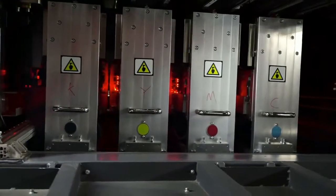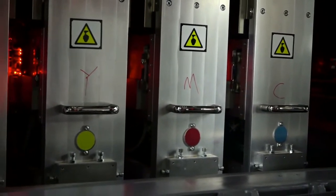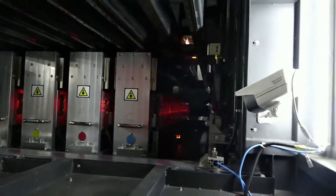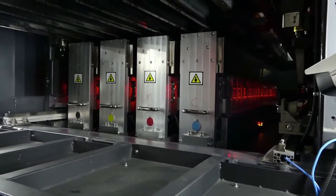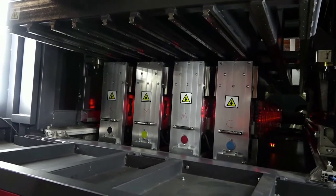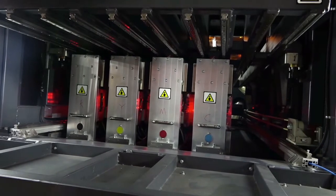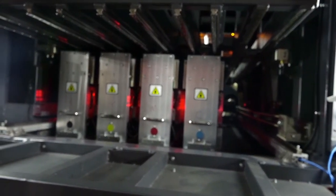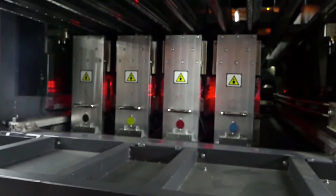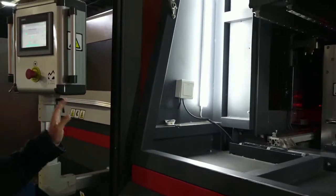There are 400 printing heads and 4 cartridges for 4 colors. As we can see, the buttons have different colors on the cartridges. There is no doubt that the printing head is the most important and expensive part of a digital printer. The inkjet printing head JS Machine uses can be disassembled and repaired, which saves the customer later costs to a large extent. Compared with flexo, the biggest difference and advantage of our digital printer is that we don't need printing plates, which means much quicker order changes and much lower cost. With the Slim 2800, the order change time can be controlled within 3 minutes. Besides, waste ink can be recycled during the printing process, and above all, the entire process is environmentally friendly and pollution free.